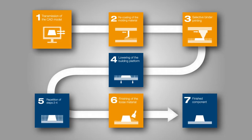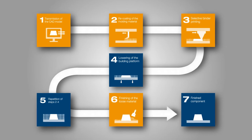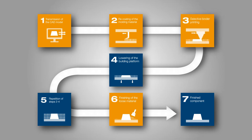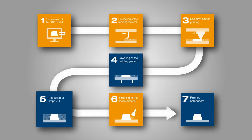When applying in layers — known as recoating — the molding material composition is discharged from a container through a gap of a specific size depending on the flowability of the molding material composition. The amount of molding material composition resulting on the building platform is shifted and compacted by the functional edge of the recoater blade in the form of a wave by a horizontal movement. The liquid binder is then applied via print module nozzles from the printhead. The building platform is lowered by a movement of the z-axis by the layer thickness, and the process sequence is repeated until the CAD data model is completed. After the core geometry has been built up, the printed areas are thermally cured in the supporting sand.